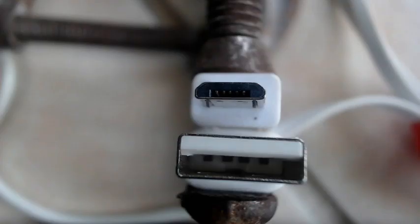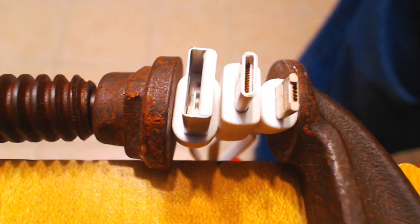Now if you have an original ESP32 device, chances are your cable is Type A to Type Micro B. The latter versions from different manufacturers — especially Seeed — are coming out with the USB Type C connector, which I think is a much better connector than the Micro B. Even the Type C is being used to transfer current on a whole lot of devices, and I'm not a big fan of this. The connector on the far right shown here is a Micro Type A and not a Micro Type B — but bear with me for a bit.